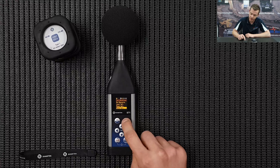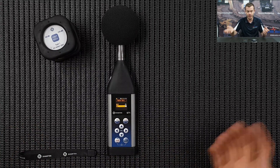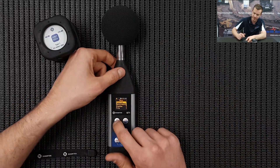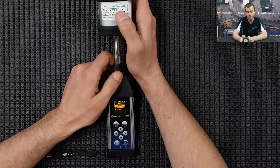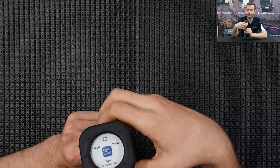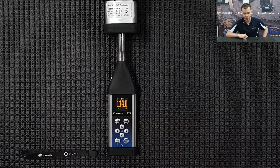After that go down to Calibration, then down to Auto Cal, and make sure that's switched on. That's going to save us a bit of time - basically once we pop the calibrator on, the instrument is going to register that there is a signal and then that data will be translated into the header info at the end. So we're going to pop the acoustic calibrator on and select your level 114, and this is going to pop up an automatic calibration.